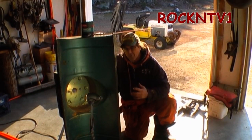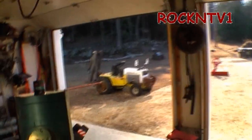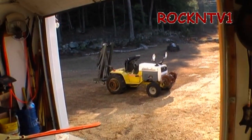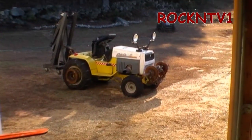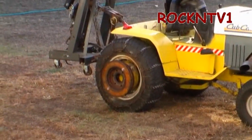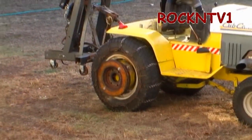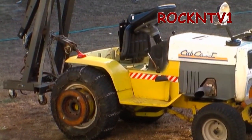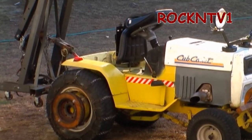So I'll show you everything that I've done here. That is the tractor it's going on and you can see I spray painted it yellow because I didn't have a yellow tractor and didn't have any of the white stickers for it. I've been adding weight to it — it's got chains on it, putting tubes and tires, and you can see the big giant three-quarter ton Chevy brake drums and rotors on the back, and some 70 pounds of steel that I got welded together into a big lump for wheel weights. MTD says they've got 50-pound or 75-pound wheel weights, and I know just from running my Suburbans that that is not enough for that tractor to come up and down my hill pushing a blade.